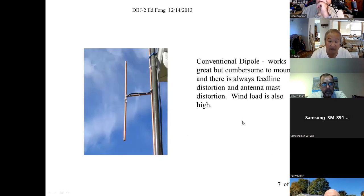So I like that. See, in the old days, you would have had a center-fed dipole. I'm sure you older hams know this. So this is just a standard VHF dipole, 2 meters. You kind of build it. We used to build these with 4 bay, and they work okay. But look at the problem with it. An average person would not go out and build this. An avid ham maybe, but an average person, no. It's pipe. You need an insulator, some type of Teflon insulator. You need coax at a right angle, where the plus goes up here, the minus goes there, and it's a dipole.